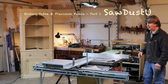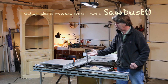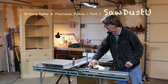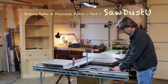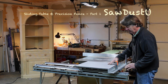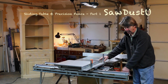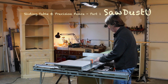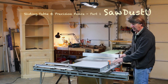So what I'm going to do is, in a minute here, we'll take a break, and I will slide this off, we'll flip it over, I'll run you through the assembling of this, the various parts, the layout of the bearings, because one of the fun things about this is you notice there's nothing here. So that when I have my sliding table, got my workpiece here, and I step forward, I'm not running into any rails or beams or any support system for the sliding table. It enables me to stand right here over it, control the workpiece as it slides through the table saw, and gives me a real accurate cut.